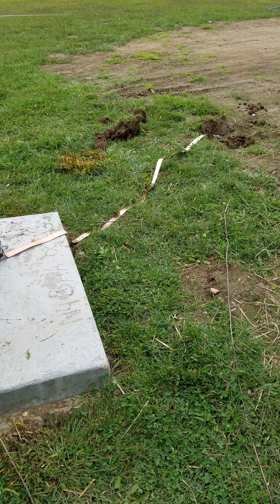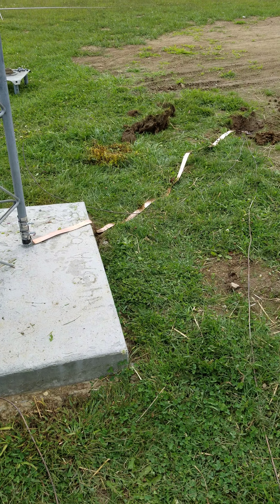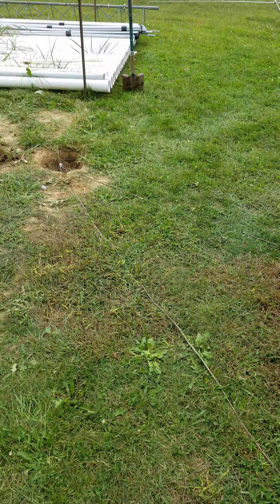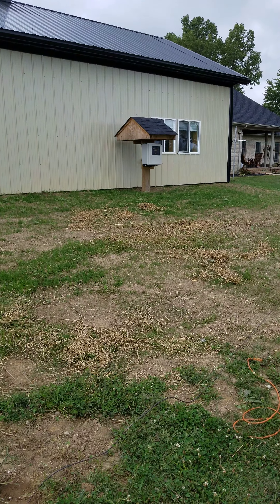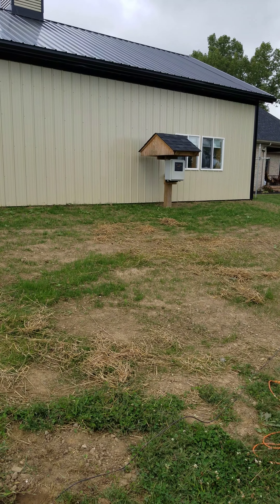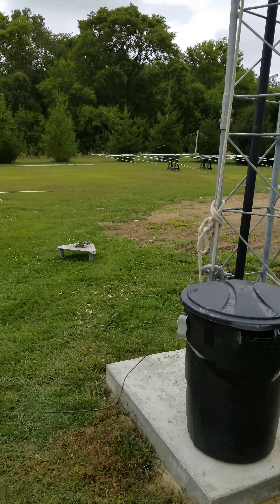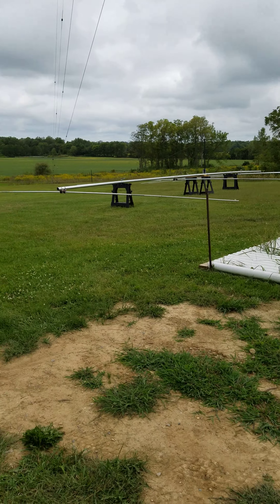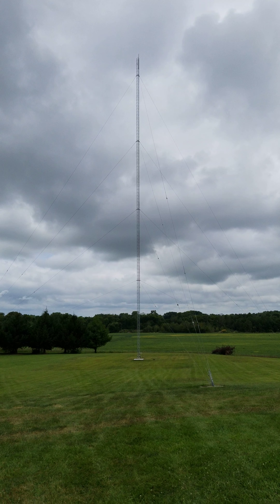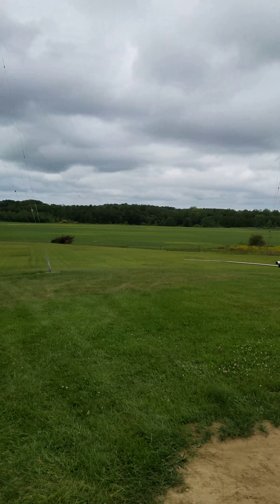That has served me well in the past — I had a piece laying around so I figured I'd go ahead and use it. The inside of the shack also utilizes all copper strapping — no braids. Solid copper is the way to go. Looking forward to the inspection, and I'll bury these wires, then we'll be in good position to move forward with the antenna installations. We'll be filming that one in its entirety — should happen in about three weeks. We'll have a 150-foot crane on site and we'll lift all nine antennas on this tower, hopefully getting it all done in about three and a half hours. As we're panning, that's the quarter-wave 160-meter vertical with 13,000 feet of radials — a hundred of them, each 130 feet long. Until next time, this is Jose, 73.